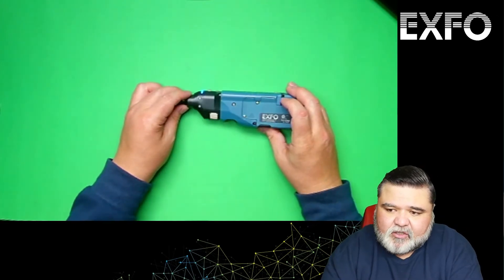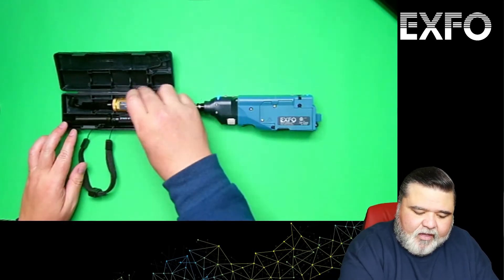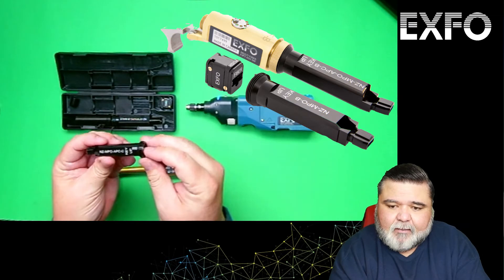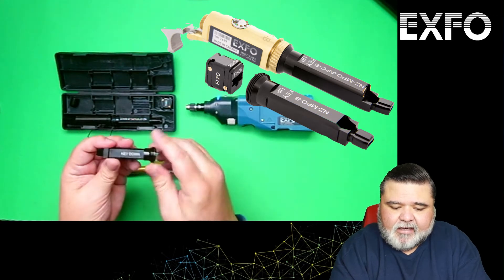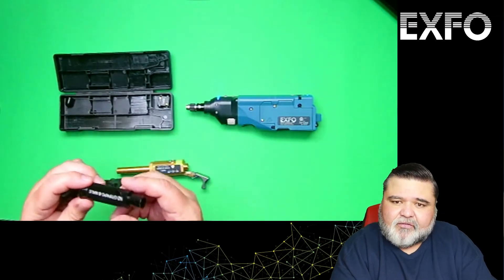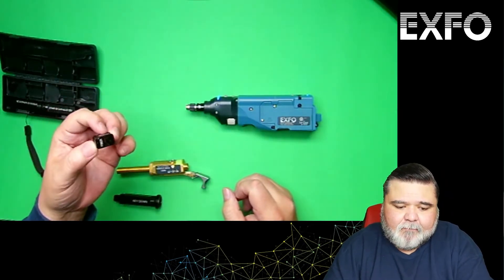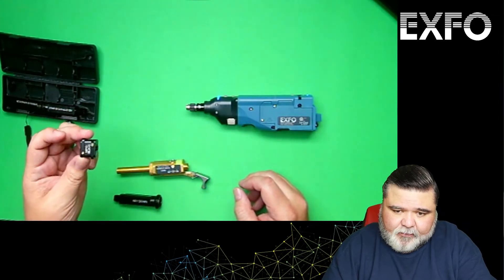Today we'll be doing MPO inspection, so I'm going to get out my MPO inspection probe tip. This is the MPO or multi-fiber inspection probe tip, with a screw on here for the nozzle. This happens to be APC. There's a key-up side and a key-down side depending on your orientation. In my kit I also have the Opti-Tip or multi-fiber hardened connector adapters, as well as a bulkhead for adapting the MPO to the fiber inspection probe tip — so we can go back and forth between bulkhead and the actual jumper interface.